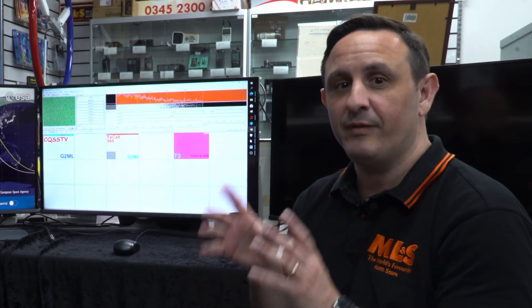The setup really is easy - just one USB cable and a couple of settings on the radio, and with the 9700 it's a doddle. Most modern radios now do have a USB connection, so if you want to do SSTV on HF, most HF radios on the market have a USB port. If you're still running an 817, you could use a SignaLink USB which gives you audio and PTT control, or an SCU-17 if you also want CAT control. On the receive side, an audio link is all you need. You can even do this with a handheld transceiver, or there are mobile phone apps where you just hold the phone up to the speaker.